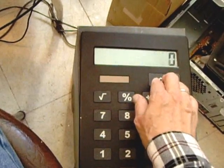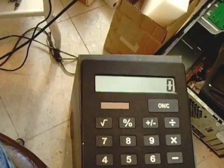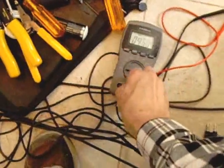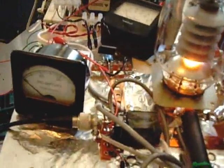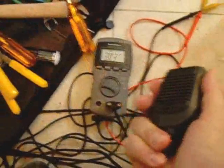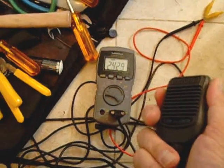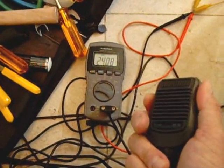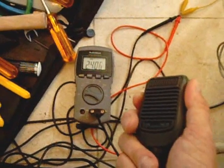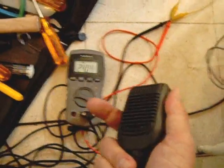We want to look at the plate voltage. In our last video we determined it's under load — it's about 2.5 kV. I'm going to change the meter to the plate voltage probe to read plate voltage. I'll check the plate voltage on the terminal below the RF choke. Unloaded it's 3,000 — a little over 3,000. With key down, it goes to about 2,400 volts. Depending on power line regulation it may go up to 2,500, which we usually like to see. Right now it's a little on the low side — 2,400 volts plate voltage.